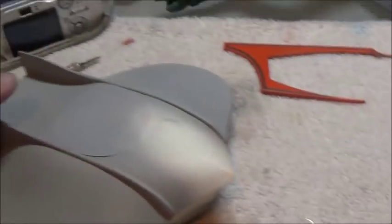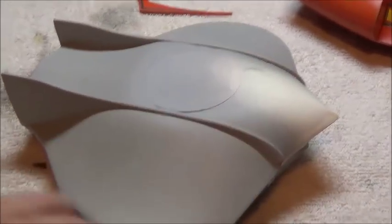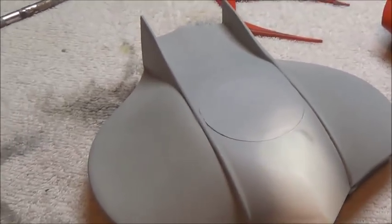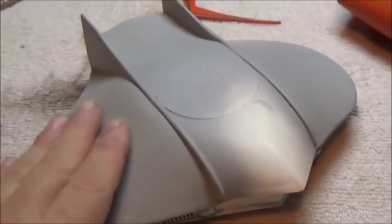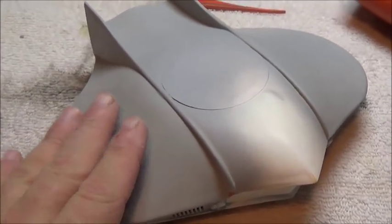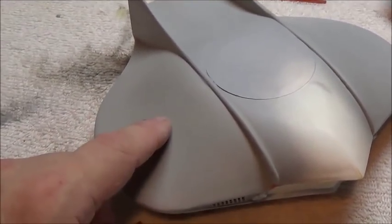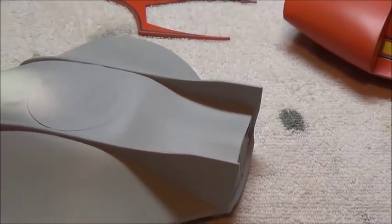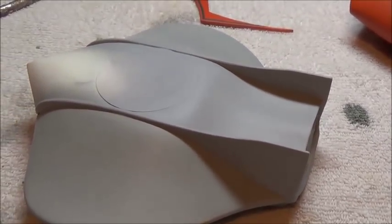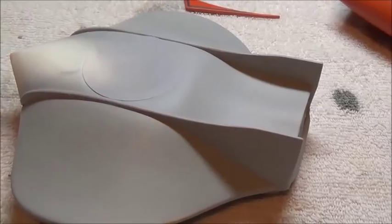Working also this morning on the flying sub. I'm going to go ahead and make the masks for the fin stripes before I start putting yellow coats on here. This is the final coat of primer, but before I start putting the yellow coats on it I need to put a white coat of primer over top of this so the yellow doesn't have to work as hard to cover the gray. The white primer covers the gray like a charm, and then the yellow will go over the white. So I just need to map out where my stripes are going to be on the fins and make the templates.